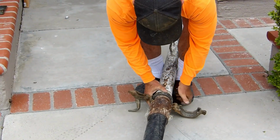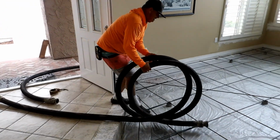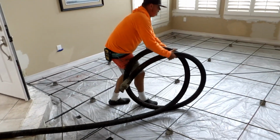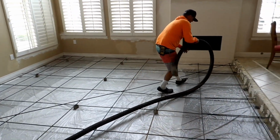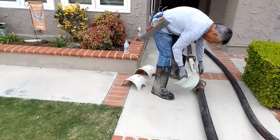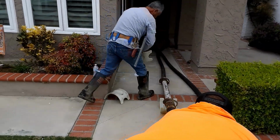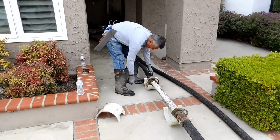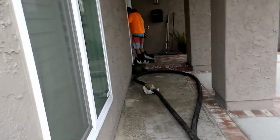We're way ahead of the concrete when we pour it. We're waiting on it usually, because the key is to place it as fast as you can and get it all tucked up and the ends, you know, get the thing bull floated, get it mag'd on the edges, on everything, ready to go, ready to skate it, mark all the joints prior to pouring it. We just use a crayon and mark them all. Not on this, there's no joints going on this. I'm just saying in general, like on a driveway or a patio.